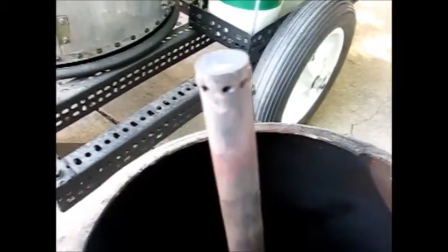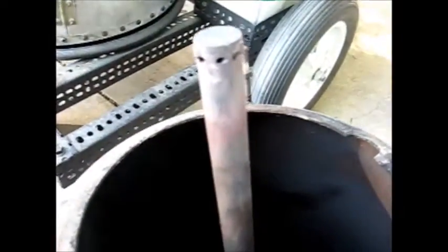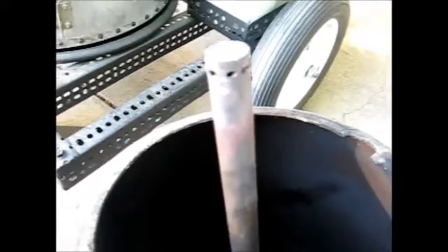What I did is I calculated the area of those holes relative to the diameter of the inside of the pipe, so that the diameter of these holes and the number of them match up so that I'm not restricting the flow out of the end of this pipe. Although I need to redo those calculations to make sure I did them right. They look a little small to me. I need to review that again. This may be a problem — it's creating too big of a restriction for the air flow that I need.